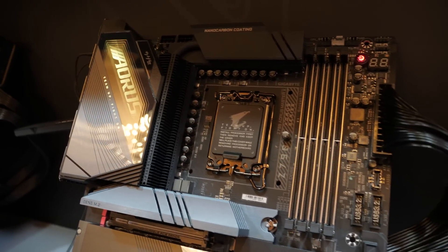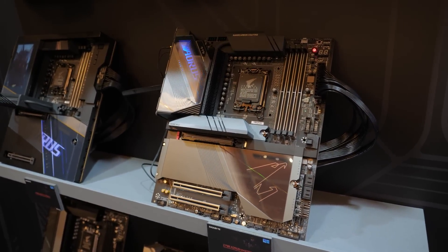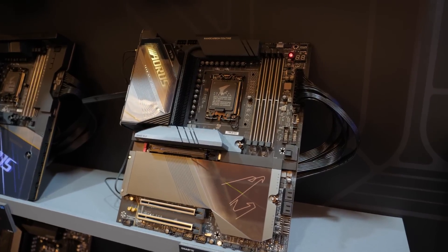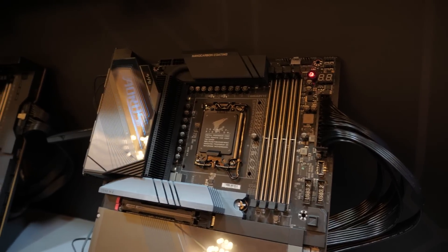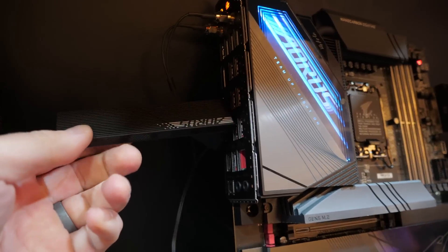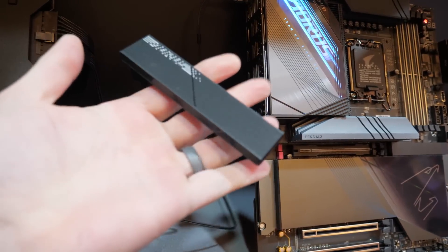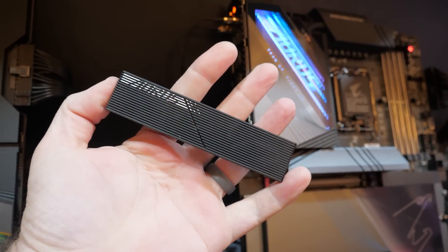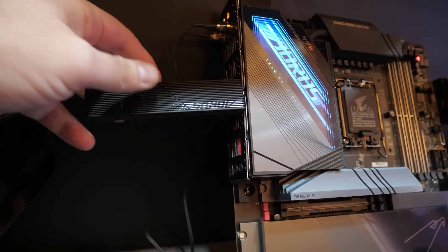So a bit of an aesthetic redesign. They've also bumped up from an 8-layer PCB to a 10-layer PCB, which is going to help these boards be rated for speeds up to DDR5-8000 — pretty speedy. We also have Wi-Fi 7 on board now. This is a little magnetic antenna that's dual mode, with a directional mode and an omnidirectional mode, so that should help with connectivity no matter where your system is set up.